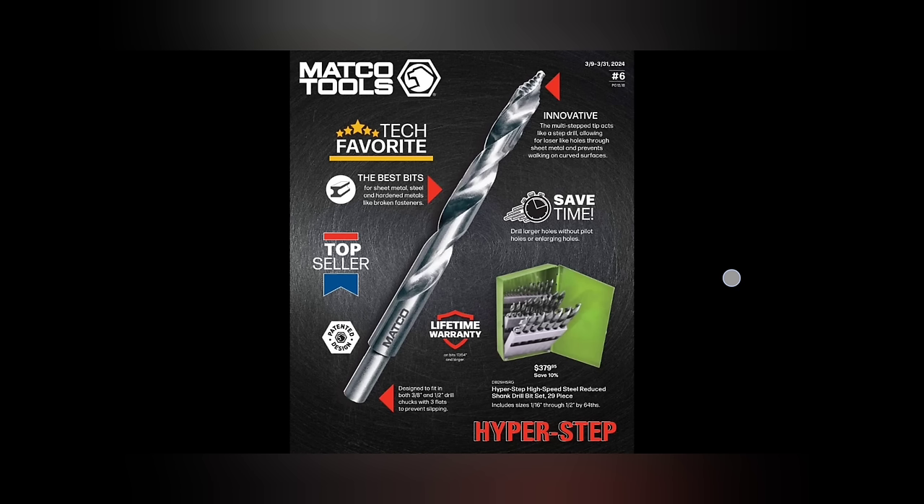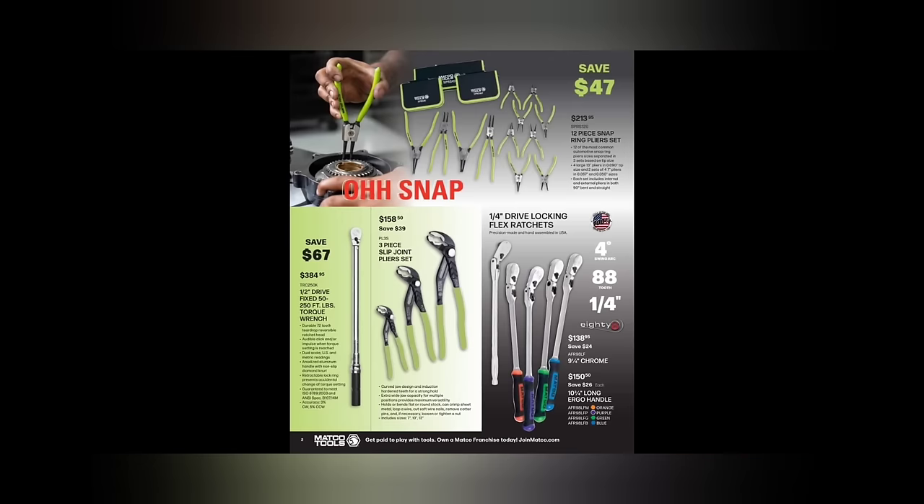I had a young tech start drilling with it and I asked what he was doing. He said he was drilling out a bolt. I asked what he'd do when he got to the bottom and he said he didn't know. That's a pointed bit — it'll drill through but it's not going to clean out the threads on the bottom, so you'll need to back it out and put a tap in there. Something to think about when you buy these bits: they're only good for drilling through, not drilling to the bottom.